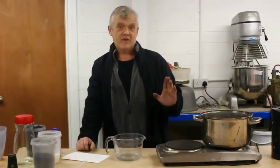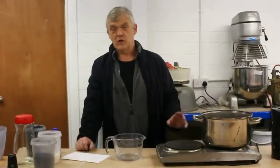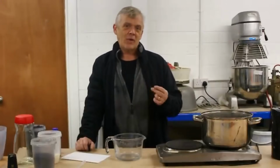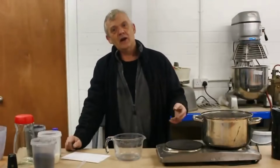So we're going to make a conductive ink. Now, conductive ink's actually really easy to make. It's a bit like cookery, to be honest, and there are 3 main components. There's the active material, which in our case is a conductive material, a binder, which is something to glue the whole lot together and glue it on the substrate you want to paint it on, paper or plastic, and then a carrier, something that keeps it liquid and allows you to do all that painting stuff with it.